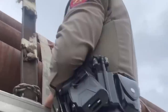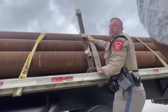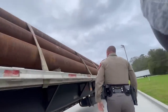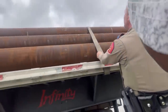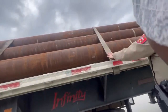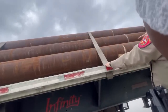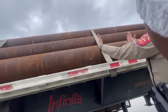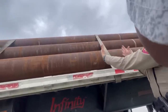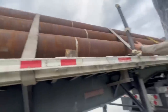Kind of like this one - it's not bad, but you've got this side and you've got this side starting to walk on you. We could count that if it had more than three-quarters of an inch, it kills the strap. That one's starting to fray so much - we can count this side, however I want to measure that. Be careful - if the damage is on opposite sides, they can count that. It doesn't matter what side it's on, as long as they're on opposite sides.